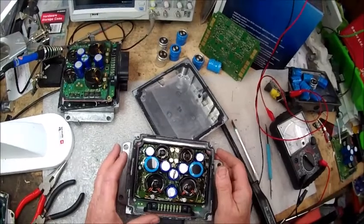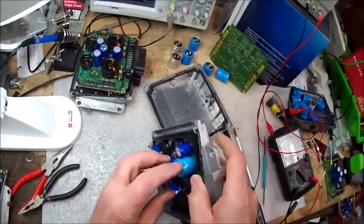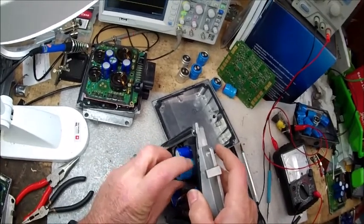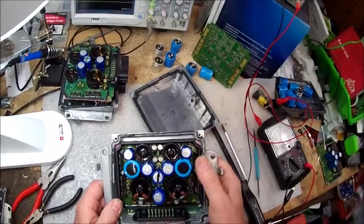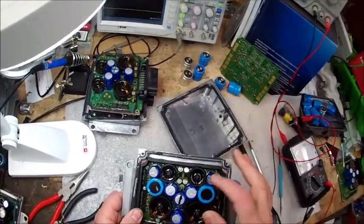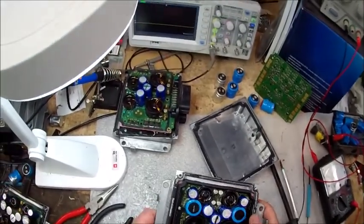That's all you can really do - you can just look at this thing and see if these have bubbled up. This one has bubbled up as well. I've had the meter on this one, and I can tell from what the meter is doing and the way it drove that I knew this cap was going bad on me. That's all you're going to be able to tell from once you get in here.